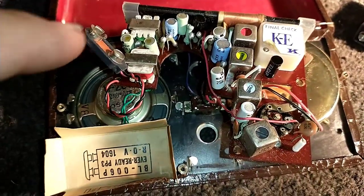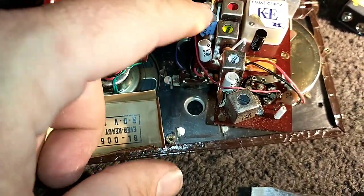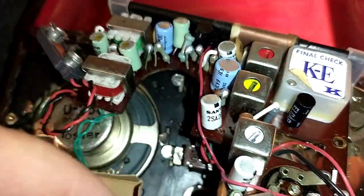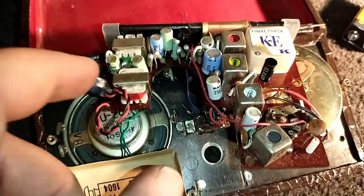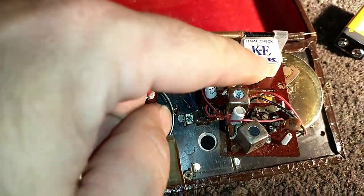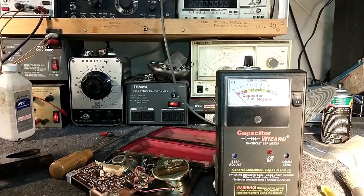Right when I open my big mouth, I discover that the green things aren't capacitors — these are the transistors. The blue things are the capacitors. In here you can see it's a 2SA200 and a 2SB137 — those are transistors. Big fat mouth. But we do have one, two, three, four electrolytic capacitors to test, so let's do some brief checks.